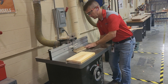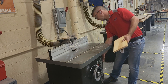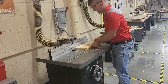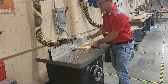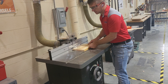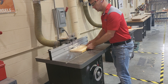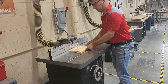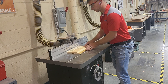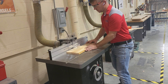All right, now let's use it. I'm going to fire it up, get my push stick out of the way, and we're going to put a little groove in the bottom of this thing. Keep pressure against the fence, my hand behind it. I don't want to follow it with my hand. I've got my plate guard in place, so just go nice and slow — you can only go as fast as the blade will let you.